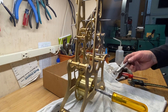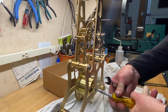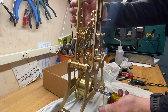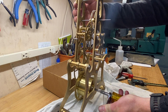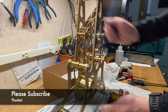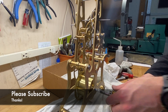Let's take a look at what we have here and see how this clock will work. We don't have a ratchet on here yet, so I've got to manually hold everything. I can put a little bit of tension on the mainspring and you see it'll lift up. Then as the clock ticks, you start to see the motion — it slowly walks down, hits a release, and comes back up. It looks good. Next I've got to make the ratchet and the pendulum, and then we should have a clock. Still a lot of work to go but we're making progress.